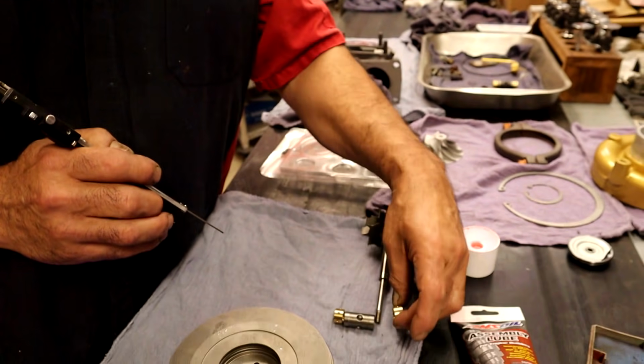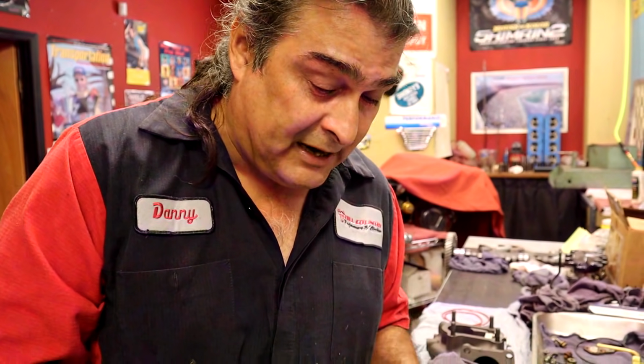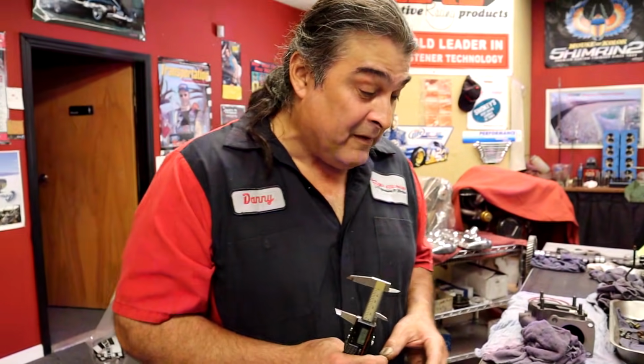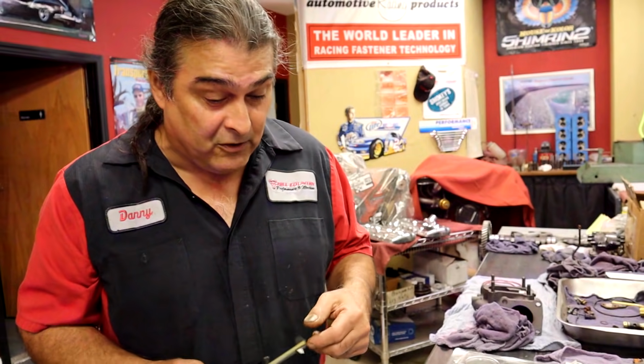The shaft should never, in theory, touch anything. The turbocharger should last 100 years, in theory, because it never rides on metal. It rides on a film of oil. So there's no friction, very little friction. The only friction there is the friction of oil. And there's no wearing parts in a turbo, so a turbo should last forever. So the number one problem with a turbo is the owner, or the assembler. The human. If you run petroleum oil, it's going to cook coke on you. It's going to get cooked, which is called coking of the oil. And then you're going to block off the oil hole, and you're going to burn up a bearing. But that's not the turbo's fault. So synthetic oil, always.